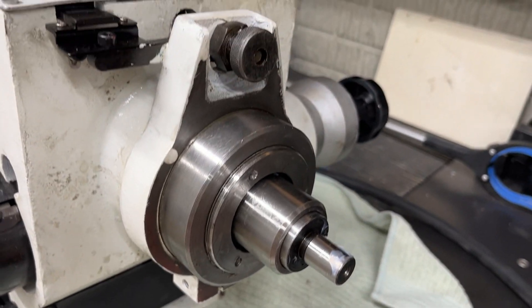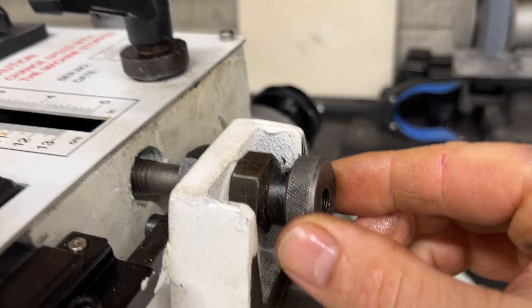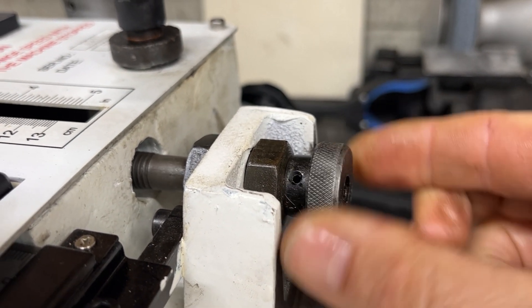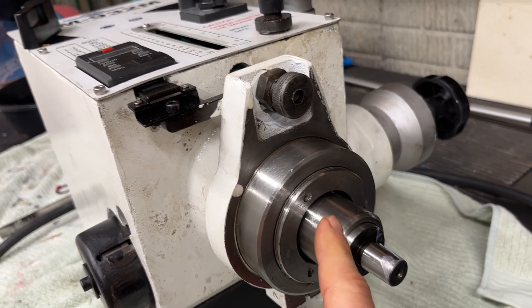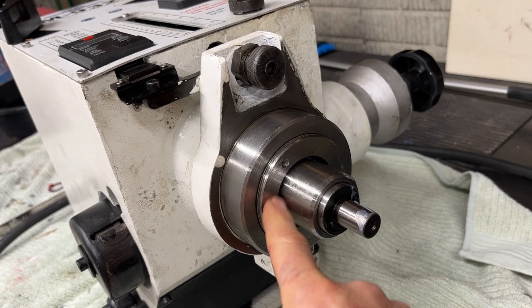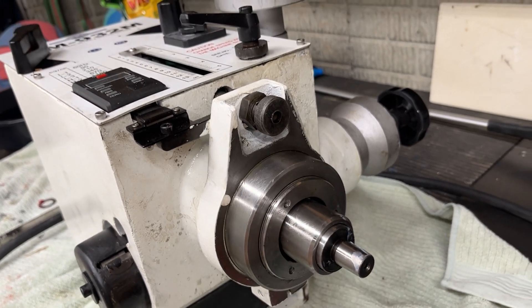This is a 42 millimeter shaft coming out. So I'll get a 42 millimeter seal and then machine something that'll press-fit into this and hold the seal, to keep all the junk from getting in here. When you're milling, chips are going to pop up and you're going to air off your vise and stuff and blow all kinds of junk in there. I don't know why they didn't do that. I guess that's what you get with a Chinese mill, but we're one part at a time fixing it, making it better. Let me go get a seal — I think I have enough aluminum to do that.